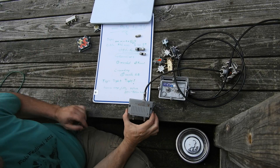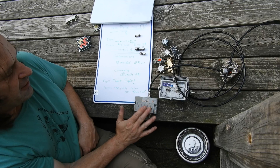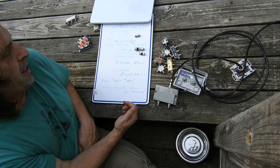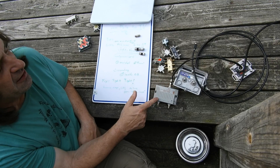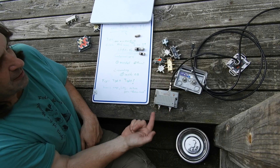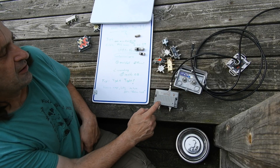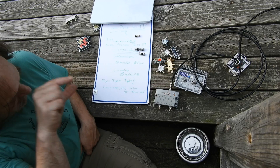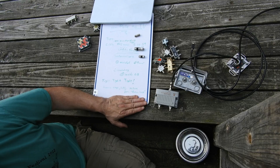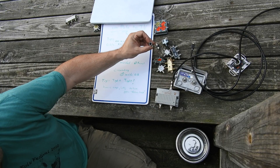As for house amps, you really should leave it to your cable company, especially with two-way cable where you've got return to worry about. Modern house amps have a passive return path. One confusing point: the old term 'return loss' actually refers to reflection loss — the signal reflected back at the input — not the loss of the return path in the amplifier. So when you hear 'return loss,' you have to know what context you're in because it's an old term and still means reflection in many cases.